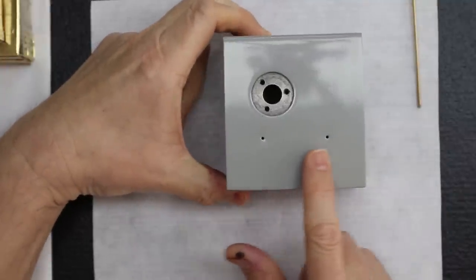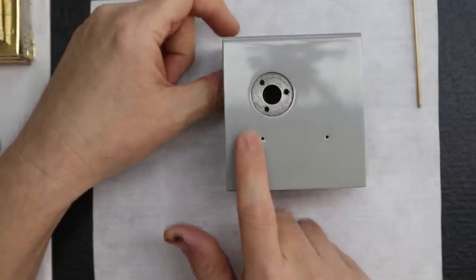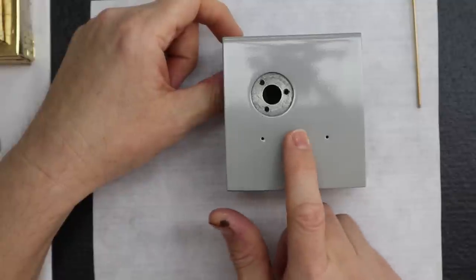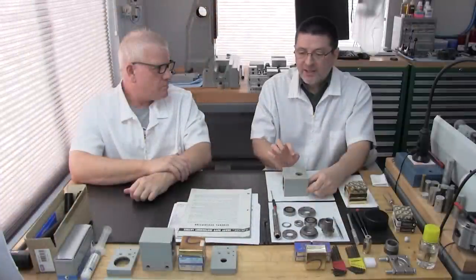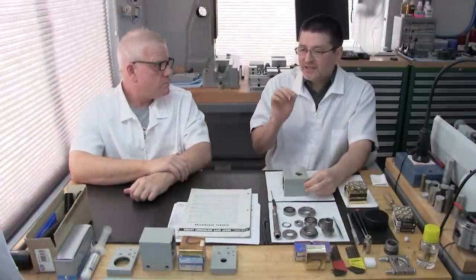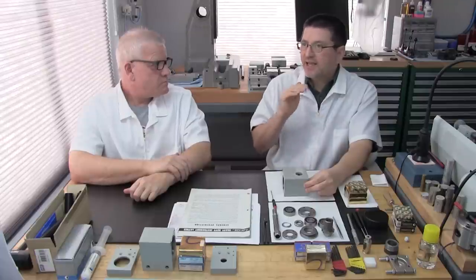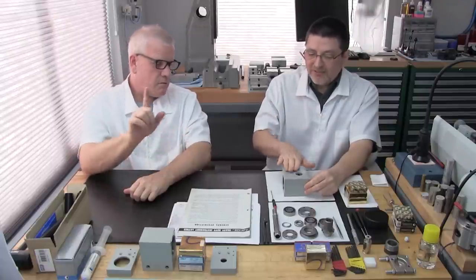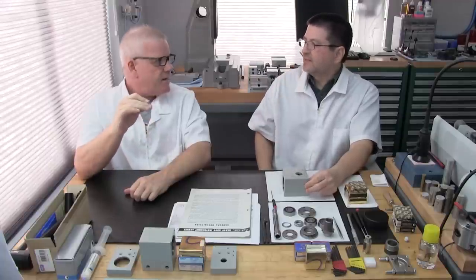See, right here, we don't have the plate. It's not installed until it's done. Yeah, exactly. The plate has the model number, and then there's a serial number. And Levin told us if the serial number is below 10,000, it's the early design that uses the flange bearings. So you want to stay away from these flat top headstocks with a serial number under 10,000.